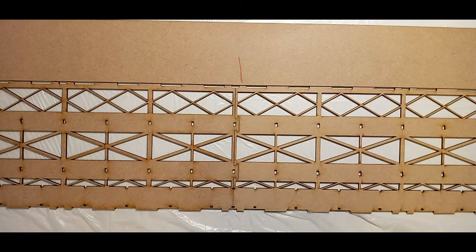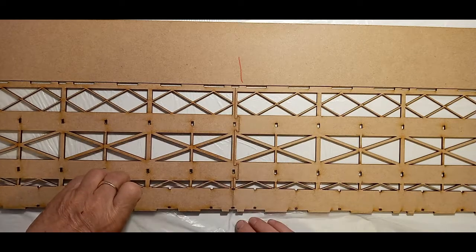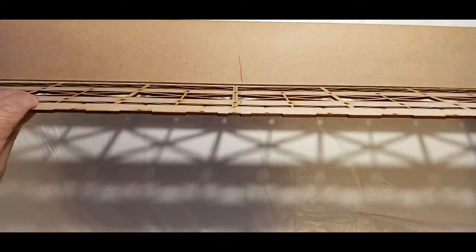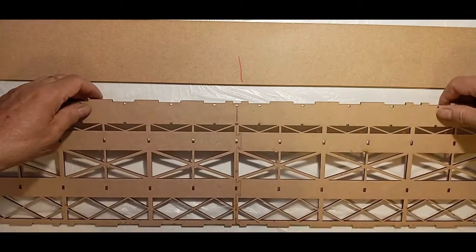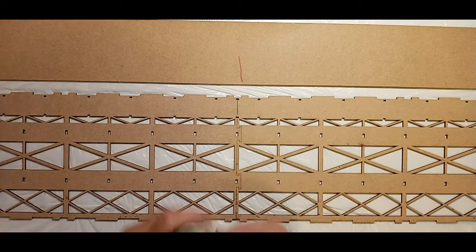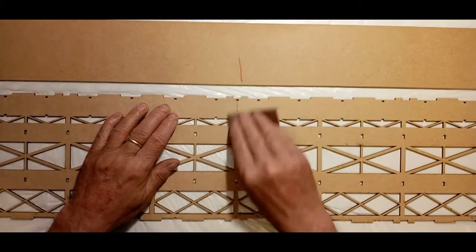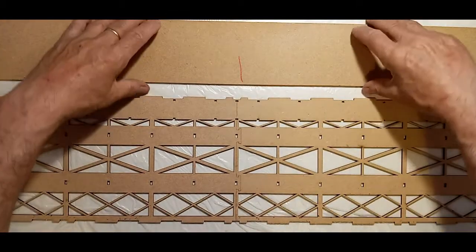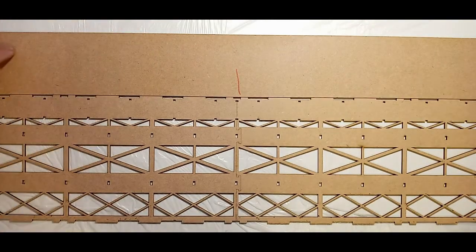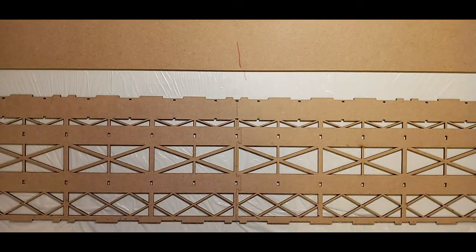And then when you're happy that the glue has gone off, we can then turn it over. So remember, it is a glued surface, so lift it very carefully. Turn them over. And we do exactly the same this side, very, very lightly, to remove any glue that's come through. Right, that completes the base. You can check this side if you want, that we've got a nice straight edge. No reason why there shouldn't be, which we have. So we can now move on to the next section.